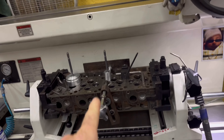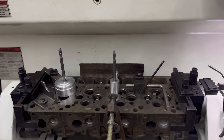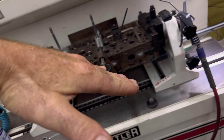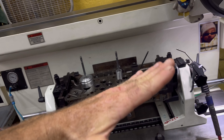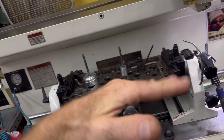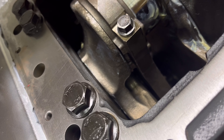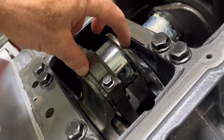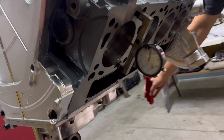With the thought of doing it twice, do I want to draw out my numbers on the tape on the board? Do I want to try to guess how much I need to surface off that end of the cylinder head to surface it on an angle to bring it level? The deck is going that way. One thing I did not do is make sure that my side clearance was right. Julie mentioned it too — we should go and check both sides. I'm just going to bar it over and check it one more time. This is just a tester rod, not the one going in the engine.